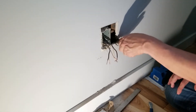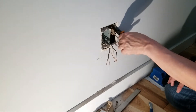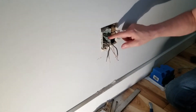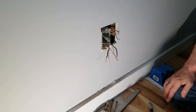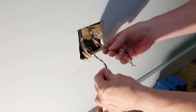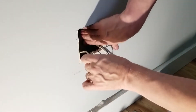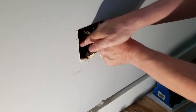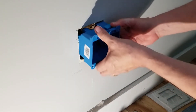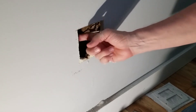I've pried the nails loose. You should have two in here — we get those out of the way. Now I'm going to take out those two screws and the box should slide out. With the metal box out of the way — note sometimes the ground wires are tied together so you'll have to separate those. I'm just going to throw the wires inside the opening so I can see how my box fits or does not fit.